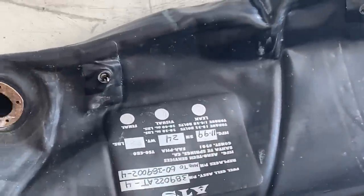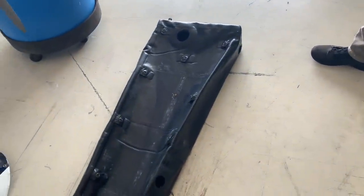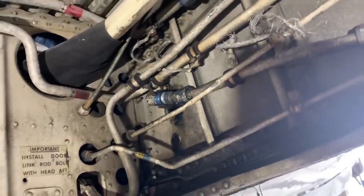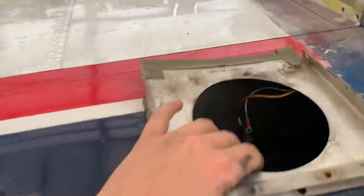Manufactured November of 1999 — were you born then? That's two years before me. I was 10, running around doing stupid stuff, and now I'm here doing stupid stuff. On the last leg, on the last bladder, we need to remove this here from the firewall, because it extends into the tank and goes to the pickup for the fuel pump. It's really hard to get to all that, but we'll get there. These bolts weren't tight at all, which is probably where most of that leak came from. There's a little bit on the outside but most of it probably came on the inside of that firewall. We'll confirm when we get this bladder off. This is a 56TC, which has this tank, which I hate.